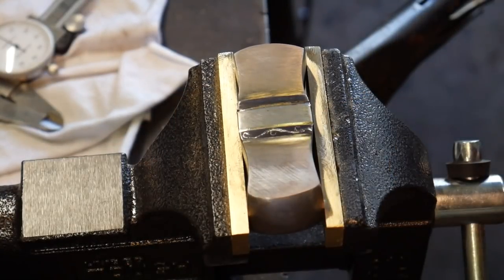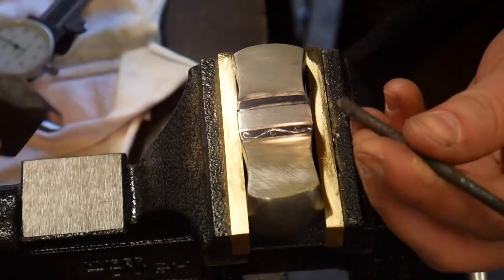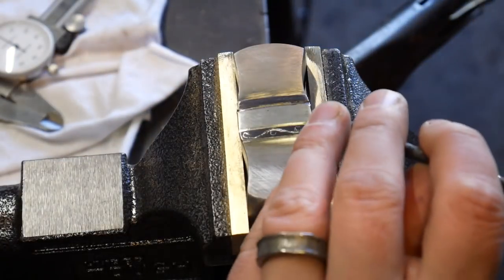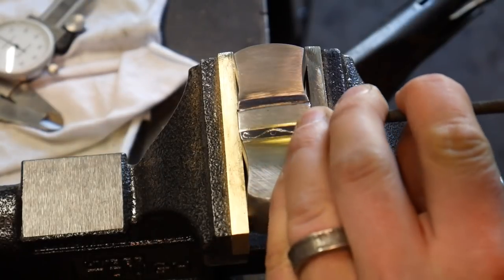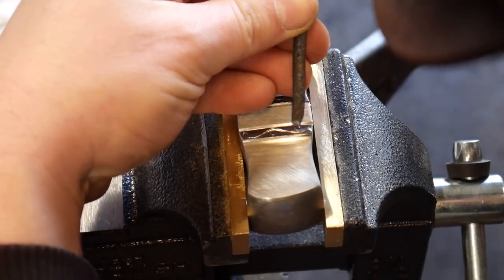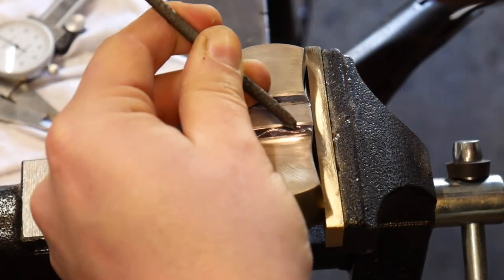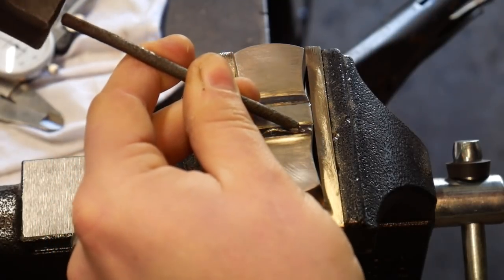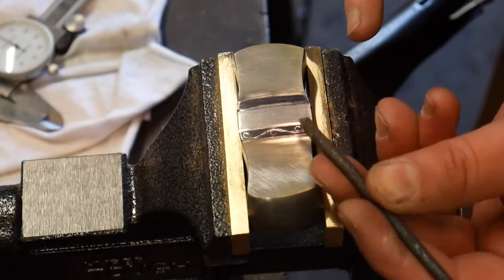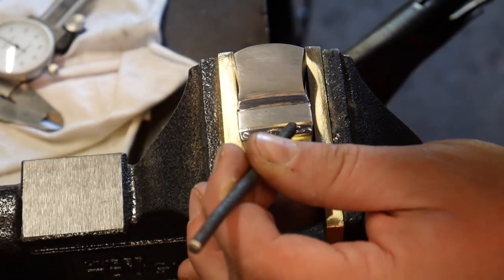When I go to the other side I'll do the same thing, and that will give us our little creeping ivy. These scrolls are a little more difficult — you can choose to start in the cut and come around, or start at the end. Just remember how you did one of them so you can do it the same on the other. When you start cutting in, it leaves a more thick end, whereas when you come out of the cut it tapers off. So depending on what look you're going for, it dictates which direction you go.